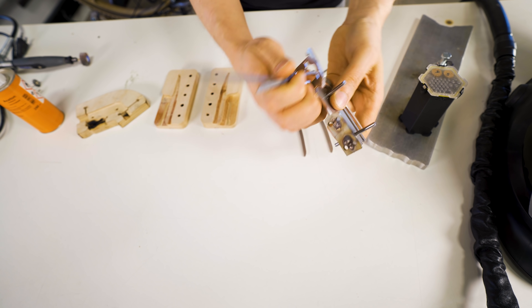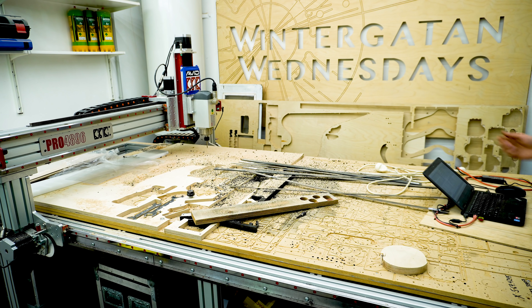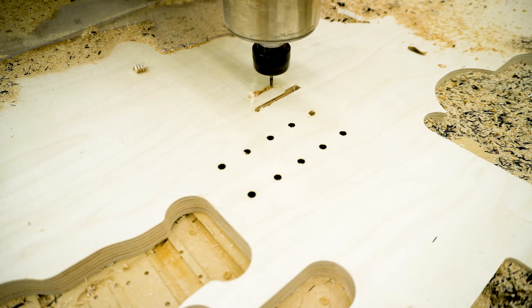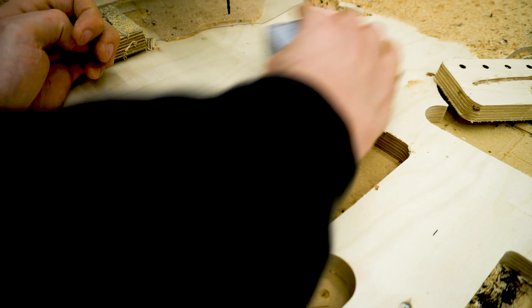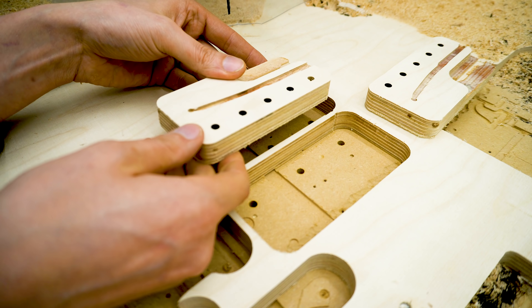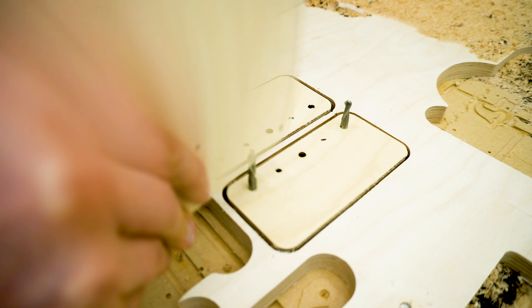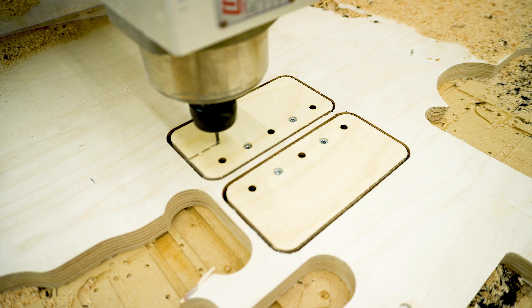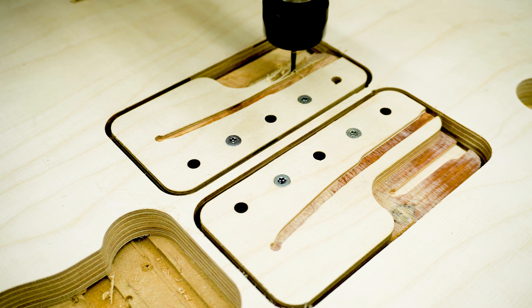To hold these rails accurately, I made these double-sided welding jigs. These are two mirror jigs and when I need to make a double-sided machining operation, I always start drilling these six millimeter indexing holes. Because then I can cut one side and when one side is done, I can flip the part over 180 degrees and cut the second side accurately. In an ideal world I would use aluminium for welding jigs like this, but I'm using what I have.